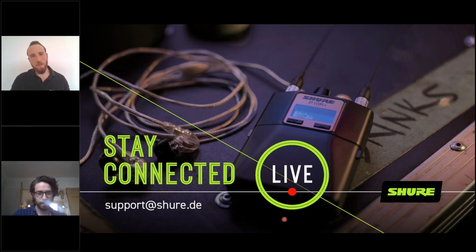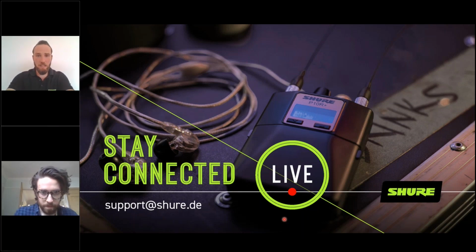I see. Well, the PSM 200 system has been around for quite a while. The PSM 200 system only features the mono mode, so there's no possibility to use the stereo mode or the mix mode. Also, the receiver is a lot larger than the handy PSM 300 you can see here, which is made of metal, whereas the PSM 200 is made of plastic. Also, with the PSM 300 P3RA, you can use the SB900A batteries, as I pointed out earlier. With the PSM 200, I think these were, no, I know those were 9-volt blocks. And of course, battery life is better on AA batteries or SB900A. That is the best option.